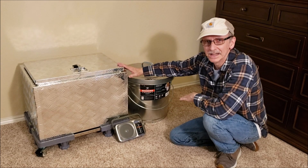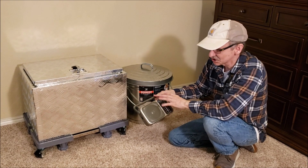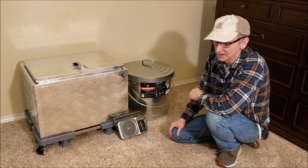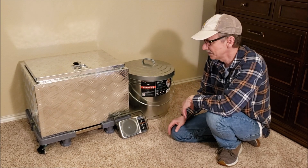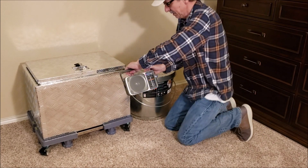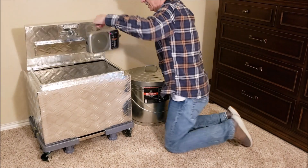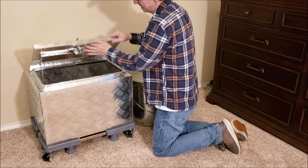The way I test my Faraday cages to find out if they're shielding at least 50 dB is I use a radio, find the strongest signal I can find, then put it inside the cage, put the lid on, and see if the signal goes away. If it does, I probably have about 50 dB shielding, and that's adequate to protect my electronics according to Dr. Bradley - you can see his link below. So we gave it a try - the signal went away - so it's probably getting about 50 dB shielding on both, and that's good enough.